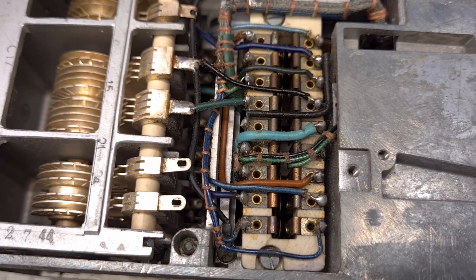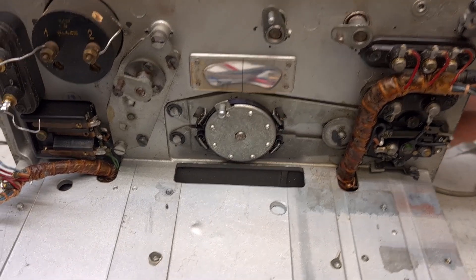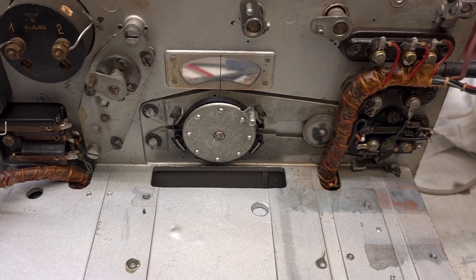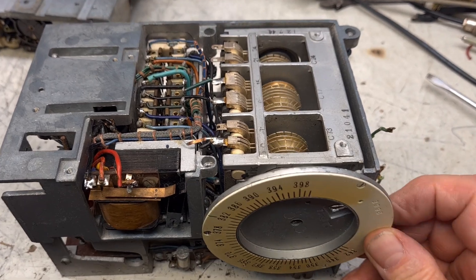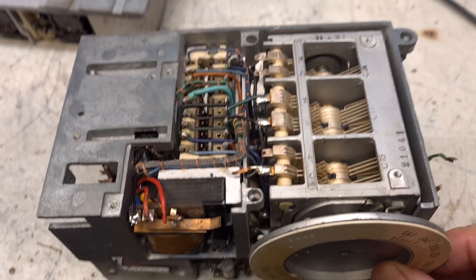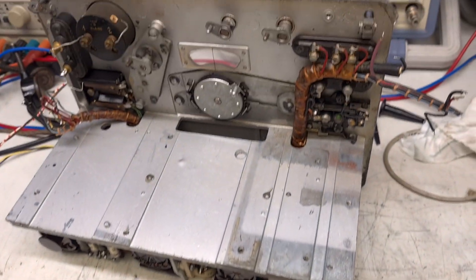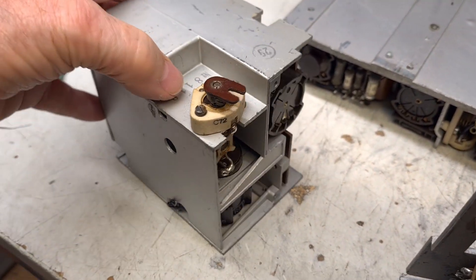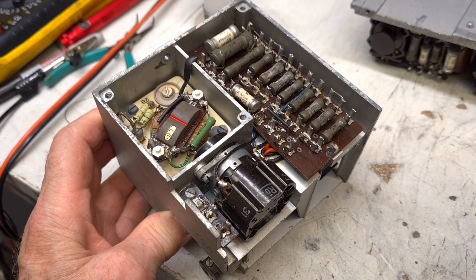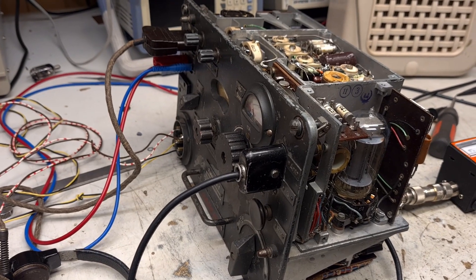Here we see the nine switches in action. The frequency button can be fixed — here we see how. The radio was set to the correct frequency before use. This is the fantastically accurate tuning capacitor — many small plates that can be bent for proper fine tuning of the frequency. Here is the oscillator with all the tuning capacitors for transmitter and receiver; the oscillator changes frequency when receiving. Here is the receiver — see the wonderful mechanical construction and how the tube is mounted. Fascinating. Finally, after hours and days of work, it is ready.